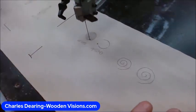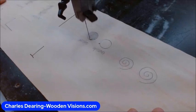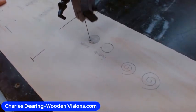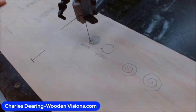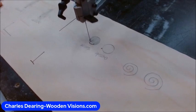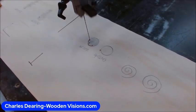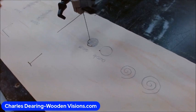The shaded areas on any of these examples are going to be the waste area, so we're cutting the inside out of this circle. Right now I'm cutting just inside that line. Let's say we go way out here and want to come up to that line — this is an example of when your confidence gets built up, you can cut just inside that line and then slowly use that spiral to creep up to the line. This will change with confidence; eventually you'll be cutting right inside the line. I always cut to the waste side unless it's a veining cut.